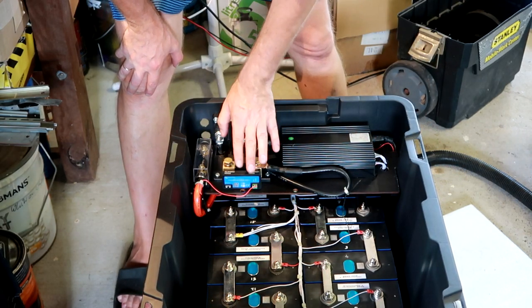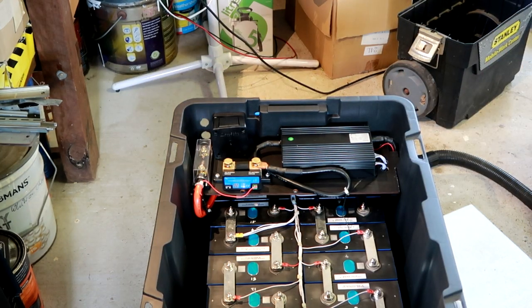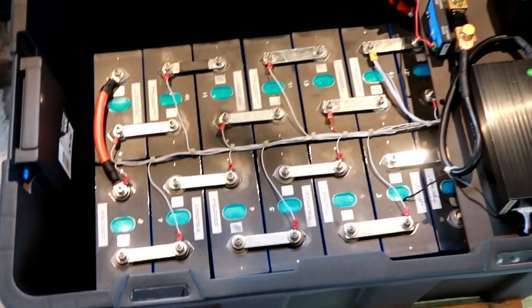We are reseating my board here with the BMS, smart shunt, and fuse. We have to connect the solar array again, just temporarily, to see the battery charges and everything is all right, and then we can do the final step and snip the cable. This was the most terrible stuff I've ever done with this battery so far — sanding and polishing these terminals is insane. I probably would not do this again. I would take very, very careful care of the terminals when I get more batteries — not scratching them and not using the bus bars before I actually build the battery.